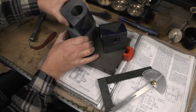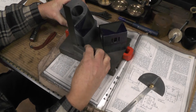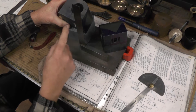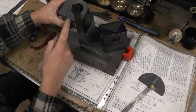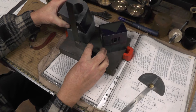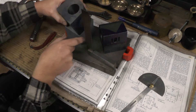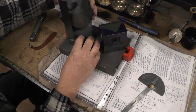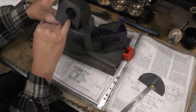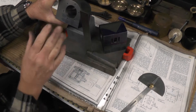That's leaving me approximately three quarters of an inch there to get three 3/16" holes in to come into the bore, once my cylinder's on that block of wood. Imagine my drill coming down perpendicular - I've got room to put three 3/16" holes into this without catching the cover holes. Looking at it that way, it'll come down from the edge of the bore down to the slots. I'll put a flat on this portion of the bore just to get my drill started perpendicular so it doesn't wander off.